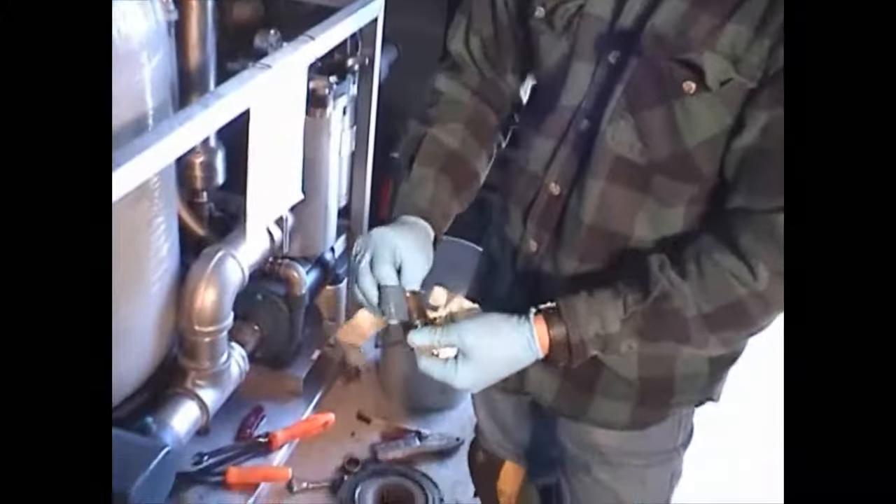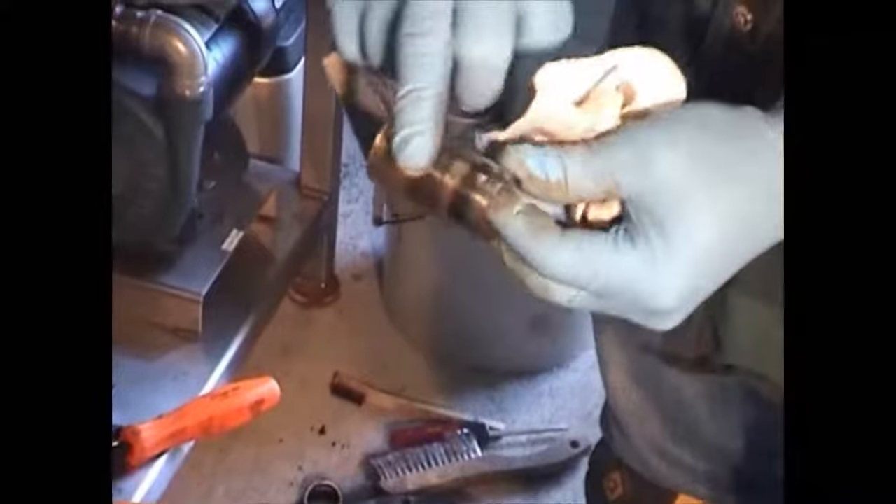Next, we're going to clean up the shaft sleeve. When you pull off the old seal, you'll notice some pitting, corrosion, and dirt. Clean that off very well so the new shaft seal will seat on it properly and there are no places for water to seep by. I like to use a fine-grade plumbing sandpaper — the same type a plumber uses for copper fittings. Take your time, do a real good job, and check it back and forth a couple of times. This gets it ready for putting on the pump adapter plate, which goes between the motor and the volute.